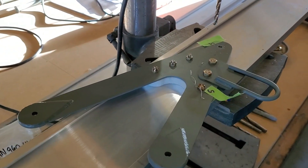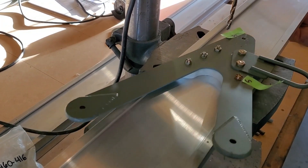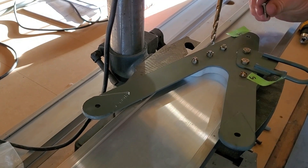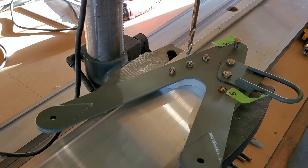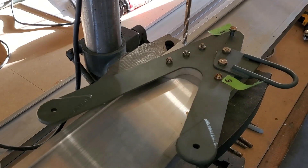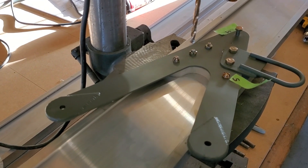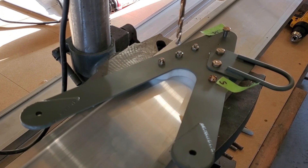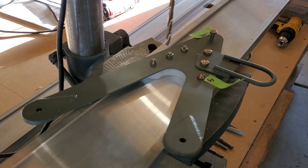It's as easy as that. Make sure that any scrap hardware you use gets put somewhere safe so it doesn't get confused with the final hardware. It's hard to do that when the sizes are different, however some people may have standard hardware mixed in with AN hardware — that's not okay. Keep your hardware store hardware away from your aircraft hardware. Stay well organized, and anytime you do a final installation with hardware, double-check everything. Every single fastener has to be tight and has to be the appropriate hardware. If you have any concerns about hardware let us know and we can help you get things squared away — it's a matter of safety. In the next video we'll give you a general overview of how the spars look after he's drilled them all.